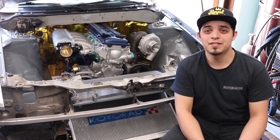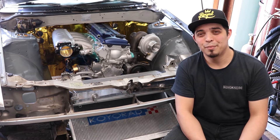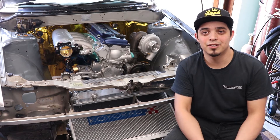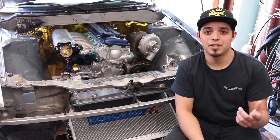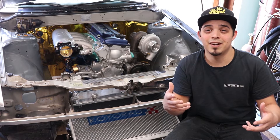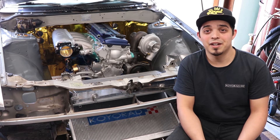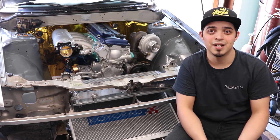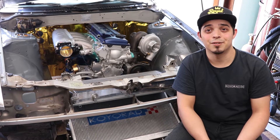Welcome back. So originally this video was going to be about me removing and replacing the stock steering rack, but as I was filming it got boring pretty quick — I mean it's the steering rack, so there's only four bolts and the outer tie rod ends. So in order to remove the steering rack I actually had to lift the motor because one of the brackets was hitting the steering rack, so I figured the motor's already up and the mounts are already off — I might as well make some solid mounts, because since day one I really didn't like the way that the hockey pucks were sitting.